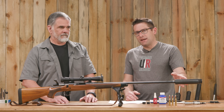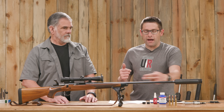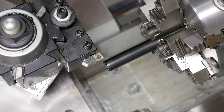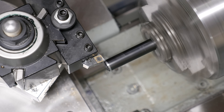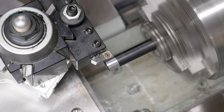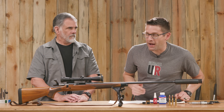To set up for the tenon turning operations I used a couple of quick tips with the DRO. Get your tool against the end and zero out your Z — your lateral movement — now you know exactly where you're going to be in terms of the length of the cut. For the diameter, I put the cutting tool right up against the surface of the barrel and typed in the number I got from my micrometer, which was .655. I took about five thousandths off with the first cut, did another measurement with the micrometer, and typed the number back into the DRO — .6364. Now we're exactly on and we know exactly where we're at with those cuts.